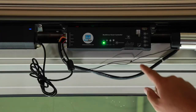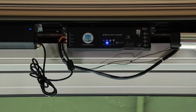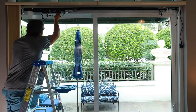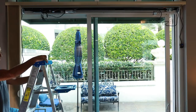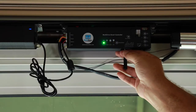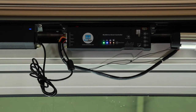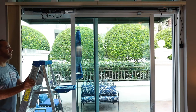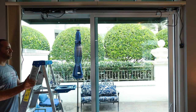The next distance to program is for blue mode, also known as stay open mode and stack mode. This mode will allow the system to open the door up to a full open and remain open. Change the system to blue mode to program the distance — the door may open when placing the system in this mode, which is normal. To program blue mode, perform the same process using DIP switch number one by toggling it to the opposite direction and returning it to its previous position. If the doors are open when initiating programming, the doors will close before beginning the programming cycle. There is no need to interact with the doors once programming begins — the doors will open slowly and close slowly, and once closed, the blue mode distance will be programmed.